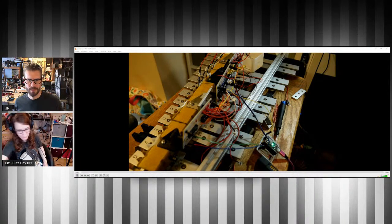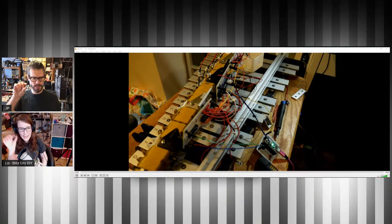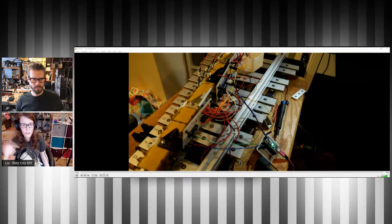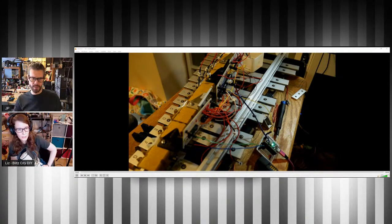But I'm excited. And are these like the 5-volt ones? Yeah, the little tiny ones. And the way the code is, because of how glockenspiels are, the faster you release from hitting the note, the better tone you'll have. So with the code, when the note is triggered, the solenoid quickly hits and goes right back up. They aren't on for very long. That'll also help with the power stuff.